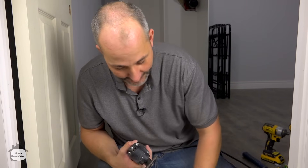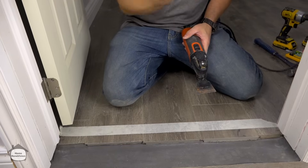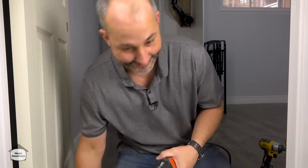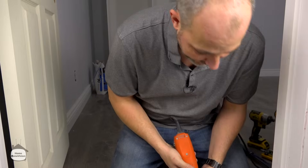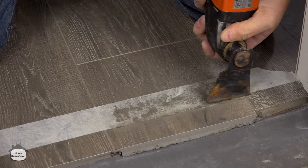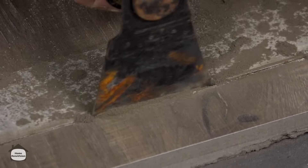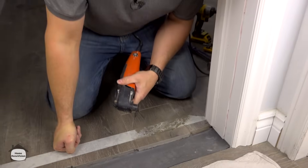Take your time when installing your flooring — always finish about a quarter to half an inch inside the door so you have room for your transition. Now I've got to pull out the oscillating tool. I put down some tape to represent where the cut line should be and I've got to cut all these floorboards off. This is going to take about a half hour and I'll probably go through three blades — so remind yourself at the door stop, check the instructions, get your line set properly, and do it right the first time.